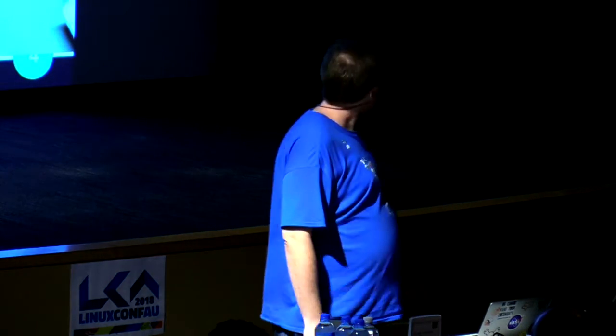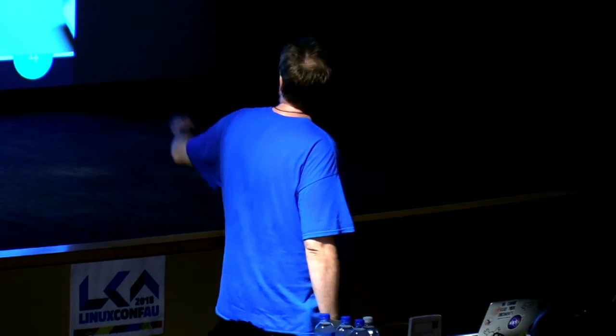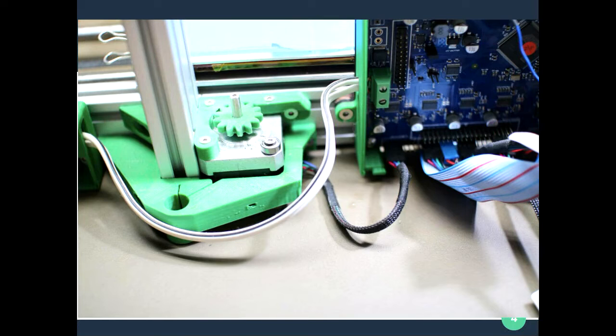In this case I had a 3D printer — a RepRap — whose software I really love, but every time I decided to print something its calibration would be way off, because PLA tends to crack. Around the stepper motor, the larger green piece on the left, I noticed two cracks, and when I took it off there were actually three cracked bits. Since that's the entire structural integrity of the machine, you can see why there were always bed levelling issues.